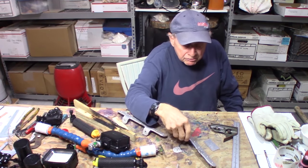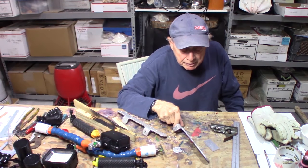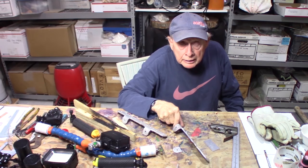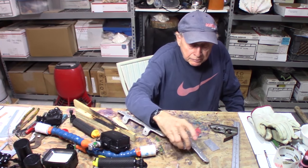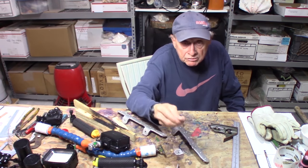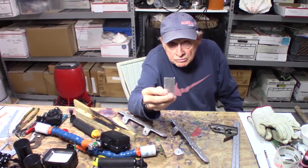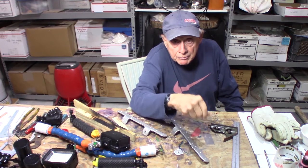What I should have done: this alloy may have been thicker, a slightly different alloy, and it may have had more tensile strength and less yield. So when I bent it — snap. What I could have done when I was fabricating and cutting the pieces out is take this scrap piece, put it in the vise and bend it, and it would have saved me all that time and effort.